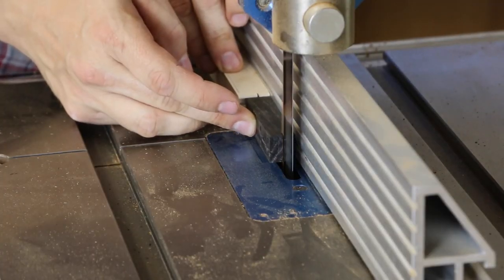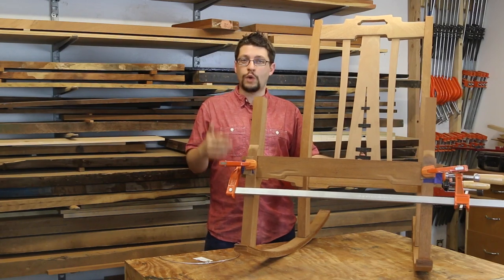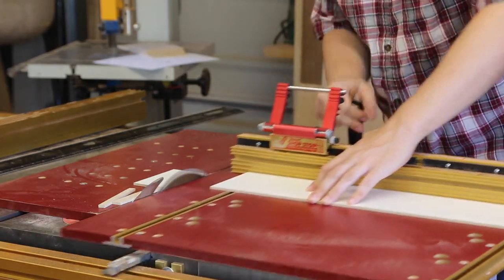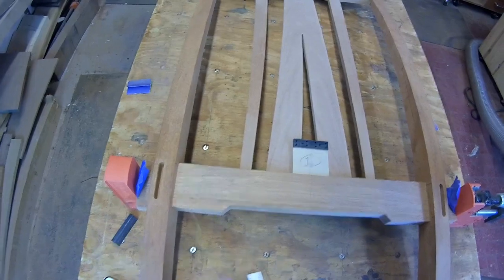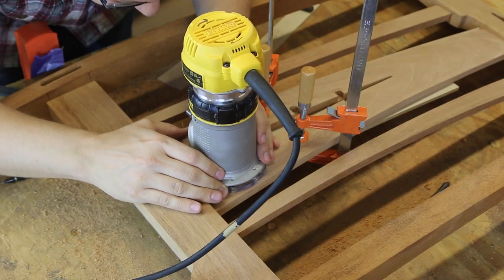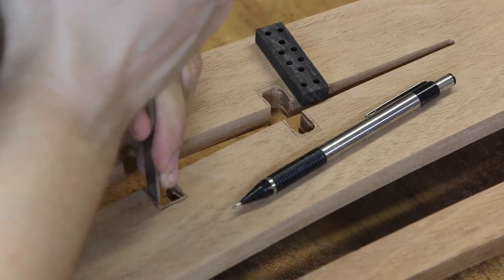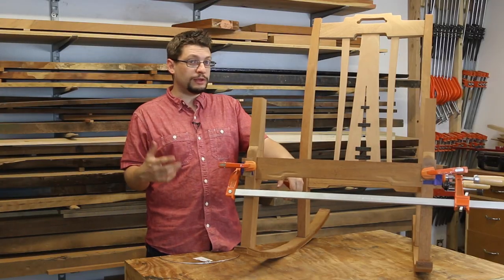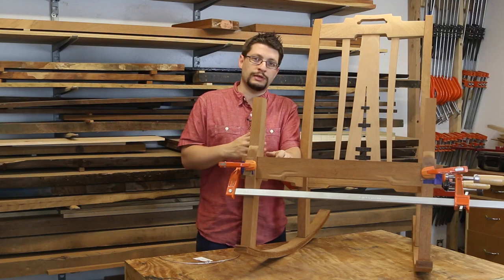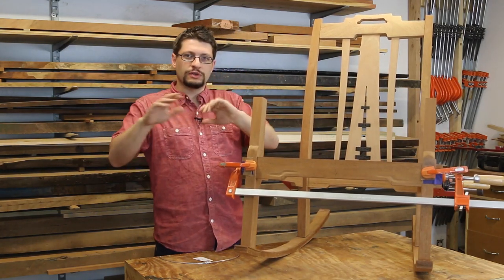After drilling the holes, I headed to the band saw and ripped the bars in half. I needed to rip them in half because instead of trying to fit the whole bar in — which is just asking too much — I fit the bars in the front and then the bars in the back. To start the whole process I cut some spacers at the table saw, put a center line in matched up to the center line on the rear stretcher, laid everything out with a marking knife, grabbed my small router with an eighth inch bit, removed the waste, then chiseled back and got all the bars in from bottom to top. I made sure to sand the ebony up to 320 before putting them in.